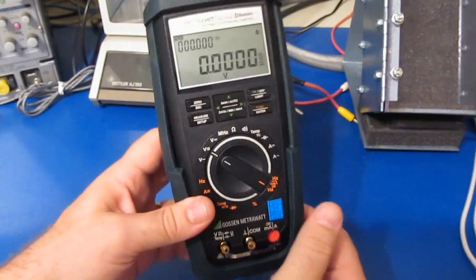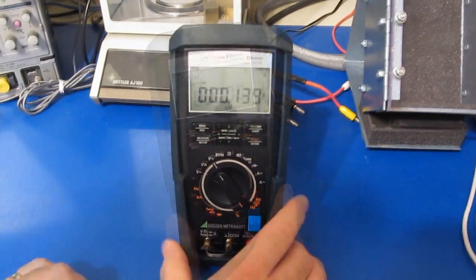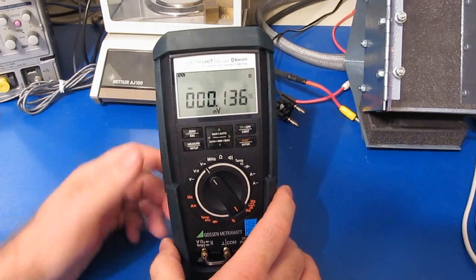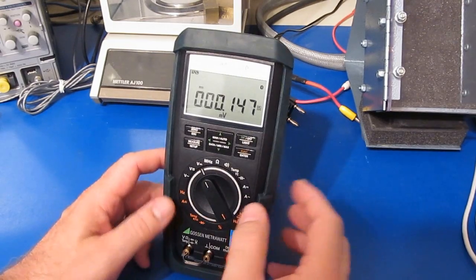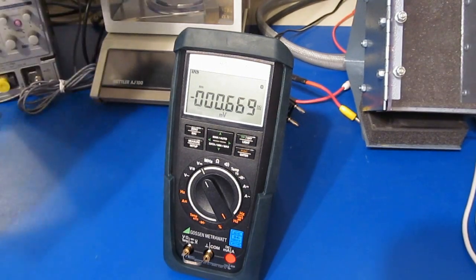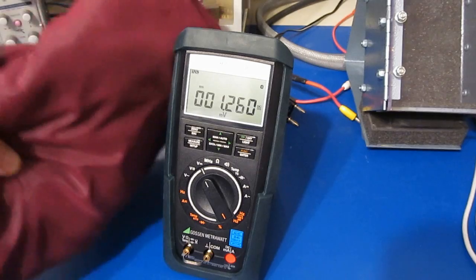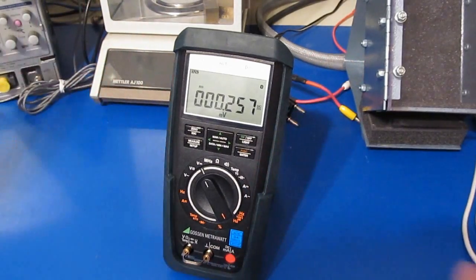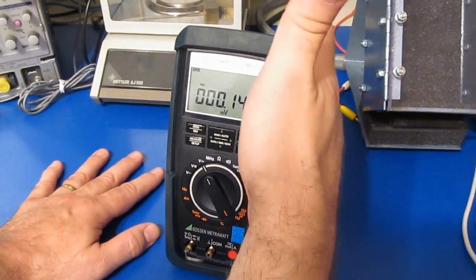They have this external battery input which isn't sealed, so any kind of contaminants can get down in there and destroy that jack, and they don't supply any kind of a rubber plug to seal it up. I looked at the price to purchase the adapter and software they offer, and it was like an additional four hundred and fifty dollars - I would expect that to come with the meter given the price. If you watch part two where I had this thing inside the chamber doing a 10 volts per meter sweep across it, this meter was quite a bit more sensitive in certain areas compared to the other meters I ran against it. I was quite surprised given this is supposed to be a higher-end meter.